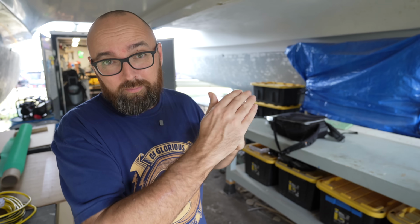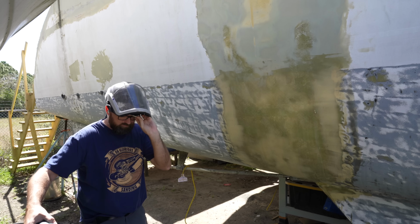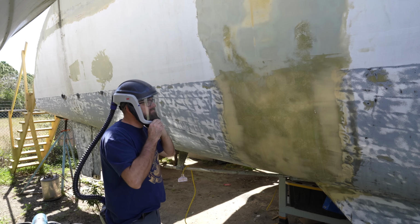And just to be absolutely clear, I'm in no way bad-mouthing or blaming Brian for this. I knew about these repairs going into the project, and besides, life just happens, and I'm sure if Brian had gotten the chance to, he would have gotten paint on those repairs. The outside skin on the hulls above the waterline is 2 layers of 22-ounce triaxial and a single layer of 1-ounce. I only have a tiny little piece of the 22-ounce triaxial, but it should be enough to let us get started to see what we're in for.